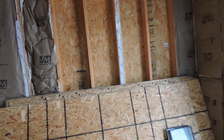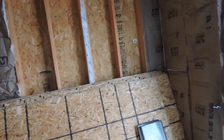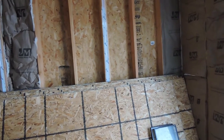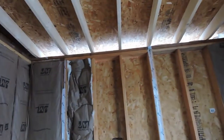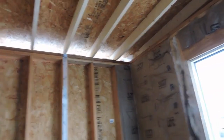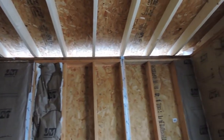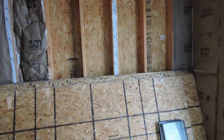As you can see, we've got siding and insulation up almost all the way around. We still have this one wall we need to do, but I'm putting a window in right there where that Tyvek tape is, so we can't put the insulation in until that's done. Then I've got to block off the top — I'll get the soffit material in, block that, and put some insulation in there.